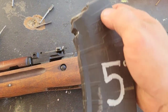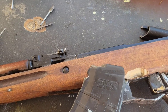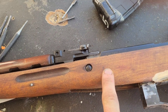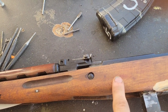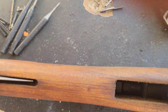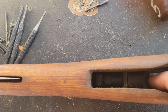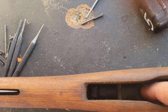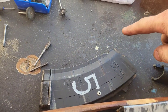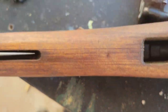In order to accommodate using these duck-bill-less magazines that have a notch cut through the front face to hook onto the stock, we've made a mark and we're going to drill a hole through our stock. When we've drilled the hole, we're going to run a pin through, and that's going to hook the front of our magazines. Where you want this hole to be is right on the leading edge of the inside of the magazine well opening in the receiver, because you're just going to catch just the very edge of the magazine with it, so you don't want it intruding too far.